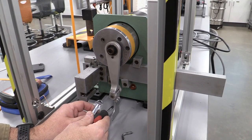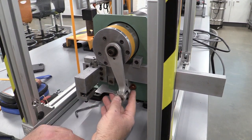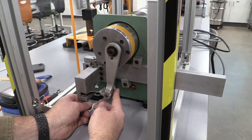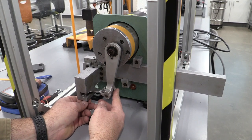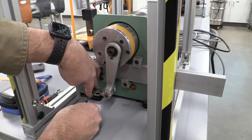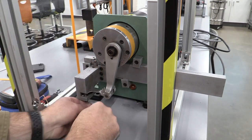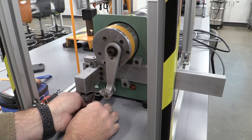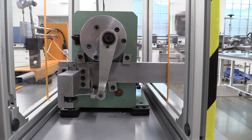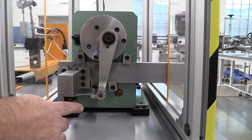We just tighten these up with the sample to the left side of the aluminum block. I'm going to slide this into the housing all the way to the back, then come in and turn in these screws in the back. I'll get it snug, then take my wrench and tighten those up so we're securely holding this in the fixture. We've just finished mounting our sample, and now we're going to measure the amount of displacement as it rotates.